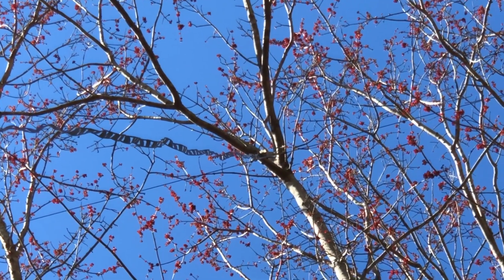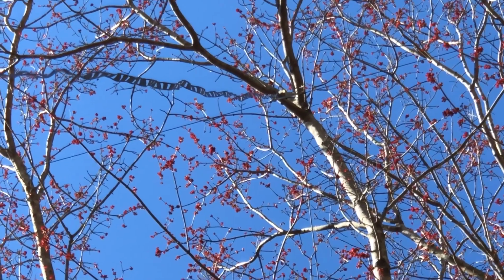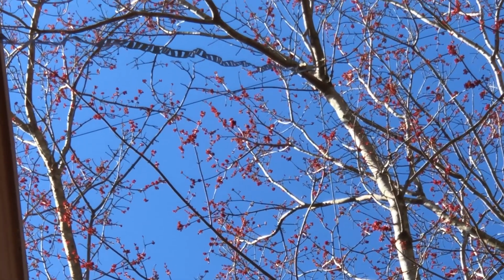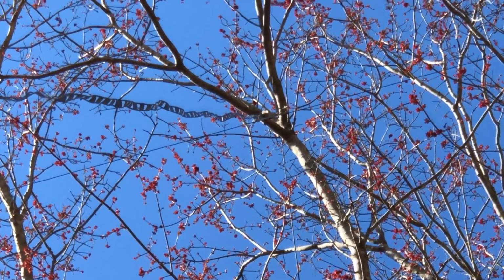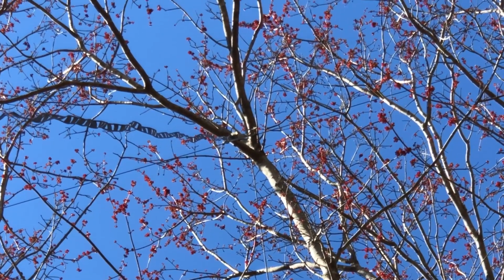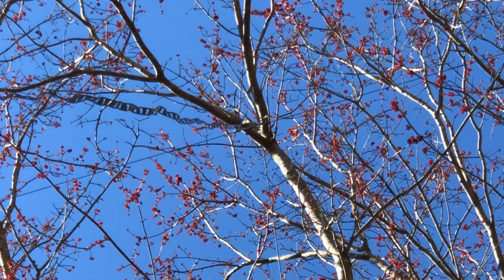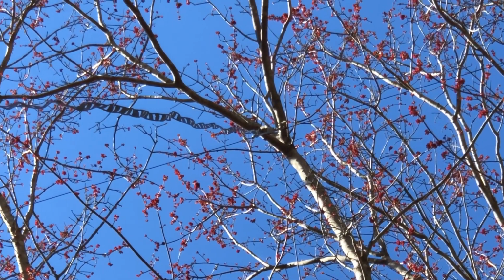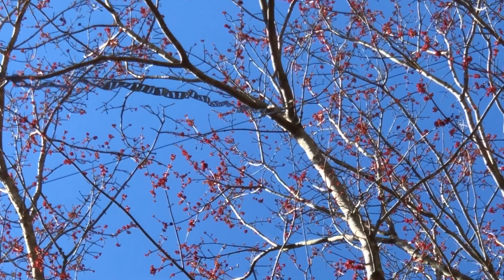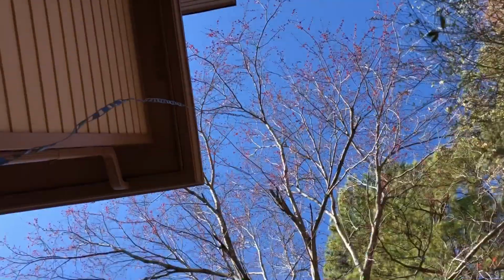When I first put it up, it was in a hurry, and I just soldered the ladder line to the leads with a dog bone insulator, and eventually it weathered and one part broke. If you're going to do this type of an antenna, I highly recommend that you spend 20 bucks and get a ladder lock, and it'll be there probably forever unless something really crushes it. Okay, so that's the antenna farm.